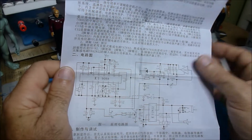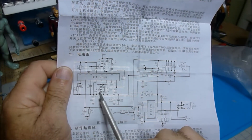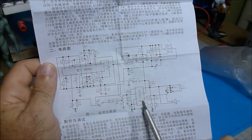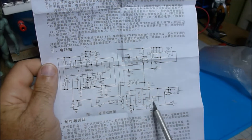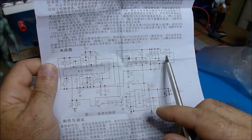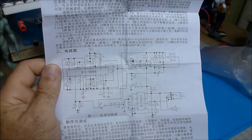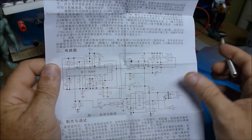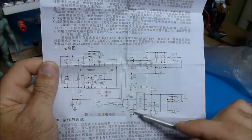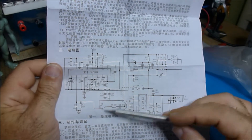Looks like we have an IC here that's going to do all the hard work. There's the FM section, there's our capacitor with our inductors. This is going to be our amplifier circuit right here — the amplification part goes out to the speaker and headphone jack. This is our AM side which is another IC, the 7642, and our amplifier here is the 2822, and then the 9088. I'm not familiar with any of these ICs really. Just a simple switch to switch it over from the AM to FM side.